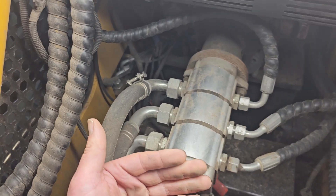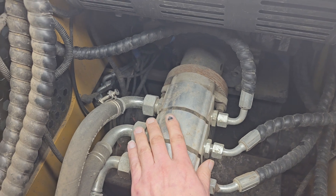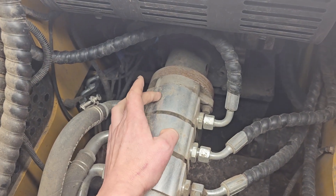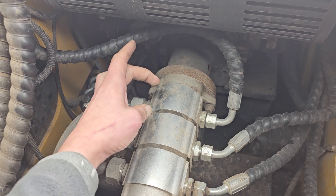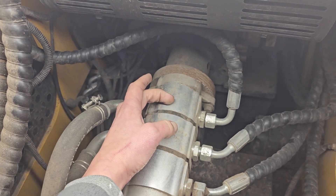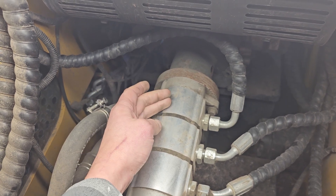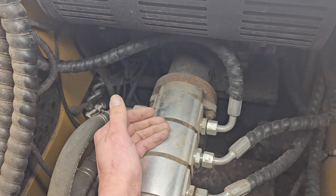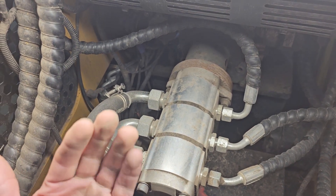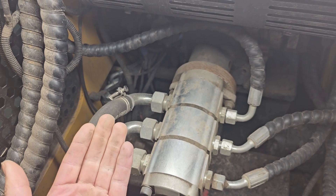So where Natster was explaining that a two-stage pump - minus one stage - would still get 15 gallons a minute but cut in half between two stages, it would basically be 7.5 gallons of flow to the pump speeding up the track, and then 7.5 gallons of flow would go to your attachment, speeding up your auger, your trencher, or what they were talking about in that thread - a stump grinder.